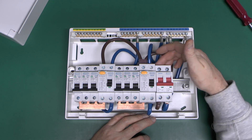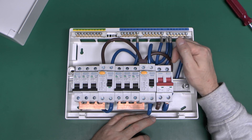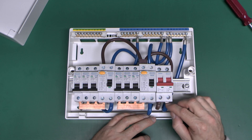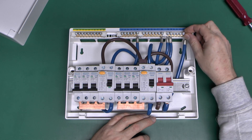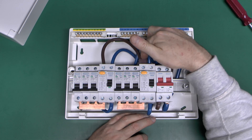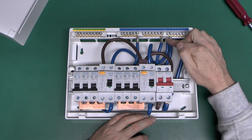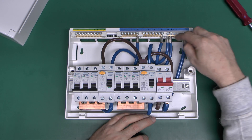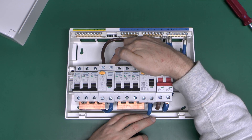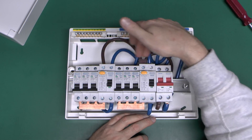The usual arrangement with these is your mains power will come in at the top of the main switch here - in this case the line is here on the left and neutral on the right. That's just a switch, so obviously on or off. Then at the bottom here we've got the neutral coming out via this blue wire, which goes up to the bar at the top. The line comes out on the brown one and actually loops right underneath there and comes out the top. That goes into the top of each of the RCDs, here and here. And the neutral from the RCDs actually goes via these two wires here - basically coming in up to there through this bar, and then two wires coming down off of there, one going to here and the other going over here.